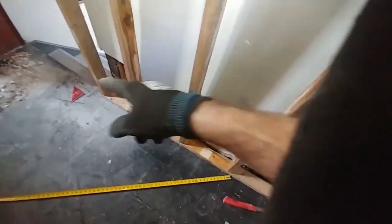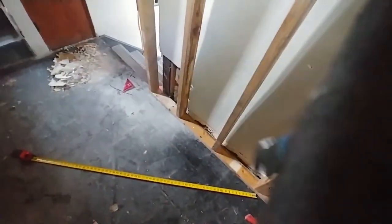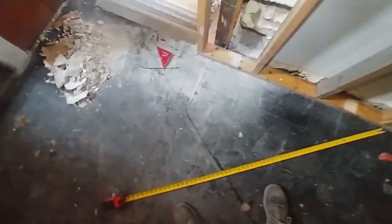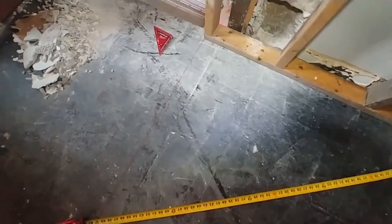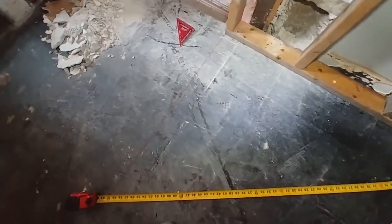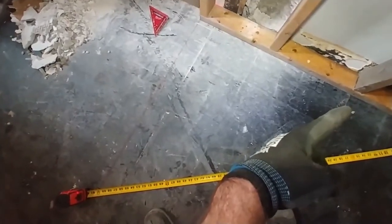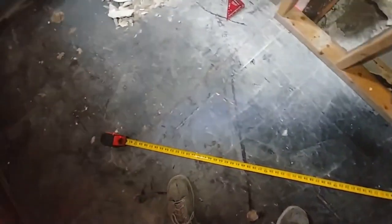So I get the chalk line, I get the wall in here, I made him a little short, a whisper too short, so I'm not jammed over here, and I want to swing him about that point until this is 90 degrees. Well, for that we use 3, 4, 5, okay? Long story short, once again, any multiples of 3, 4, and 5 will create a right triangle. Multiples of 3 and 4 are the legs that create the 90, and the multiple of 5 is the hypotenuse.